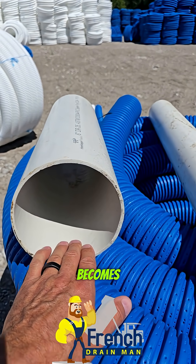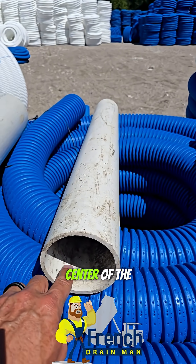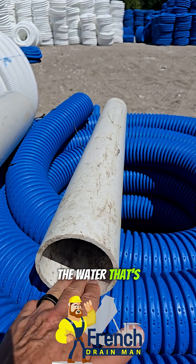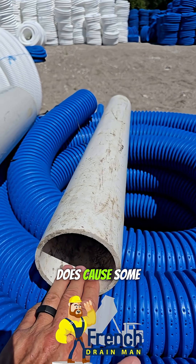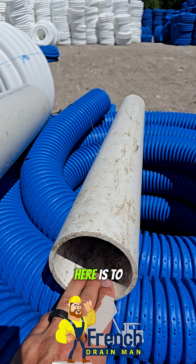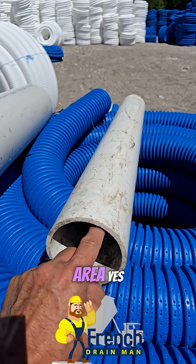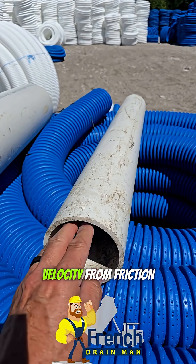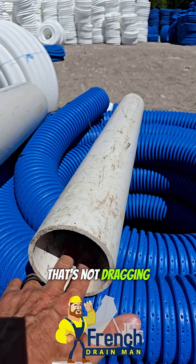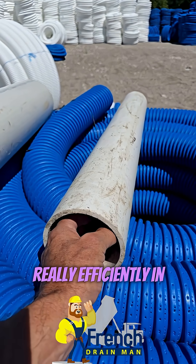You put that same amount of water in a smaller pipe and all the water in the center of the pipe is flying on a 1% slope — it's flying. The water that's touching the wall does cause some loss in velocity, especially on longer runs. But the key is to have more water up inside the pipe filling the center area. Yes, you'll have some loss in velocity from friction against the wall, but if you have more water that's not dragging on the wall, that's the key.